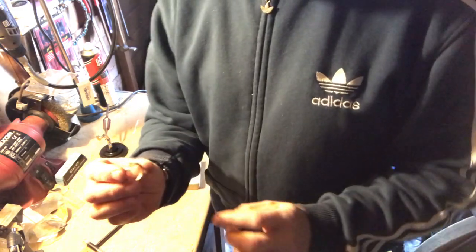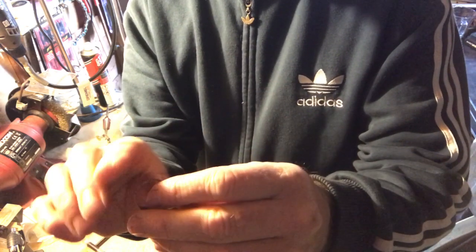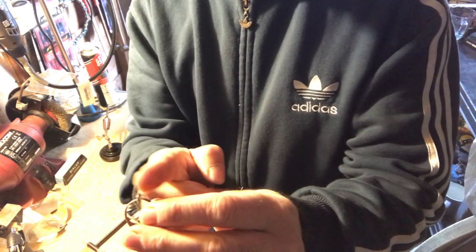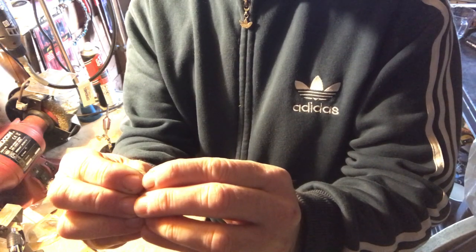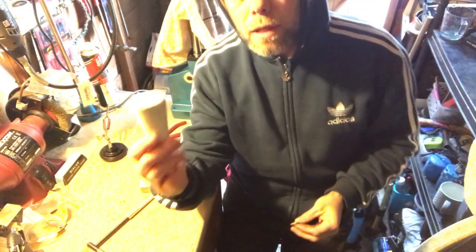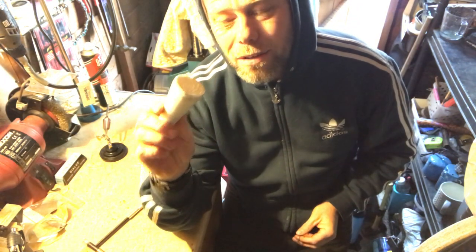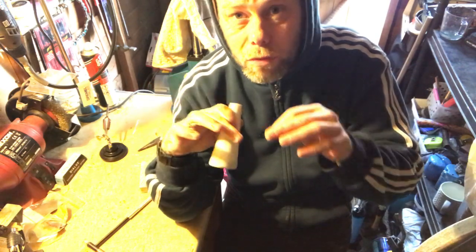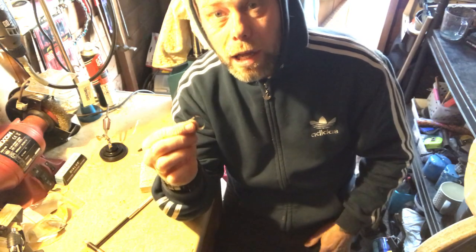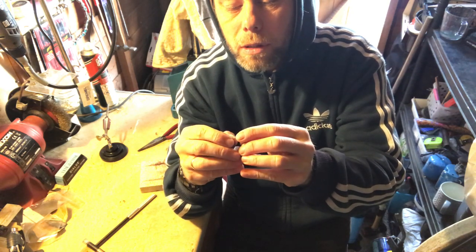So we've got it into shape, and now we've got to file the edges, sand it down a bit on the edges, file the two joints so they match up, and then get some borax on it. This is a borax block — that stops all the oxidisation when you heat it up and it helps the solder flow into the joints. But first of all, I'm going to sand it all down, polish it up, and then file the joints so they match up, and then we try and solder it.